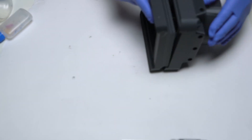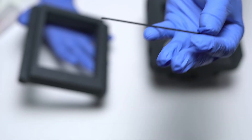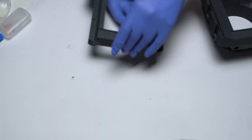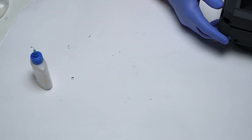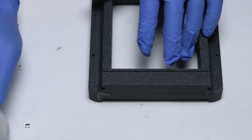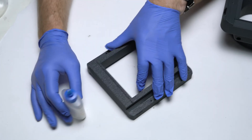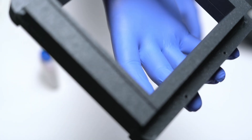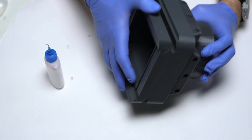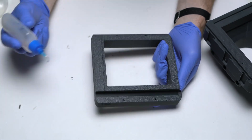This goes the same for all of the focusing backs, film adapter backs, and all of the backs — they all align like this. You glue this lock bar in and align it here, just above. Put a dot right there — about one millimeter above the hole — and just tack it on that corner. Check: did I align it good? Yes, that's aligned. Tack the other corner. It's kind of the same thing as tack welding, just chemical rather than heat. Get those two corners down and check to make sure they fit. That's a nice snug fit. That should fit on your regular Crown Graphic, Speed Graphic, whatever — it's a standard Graflex 4x5 mount.